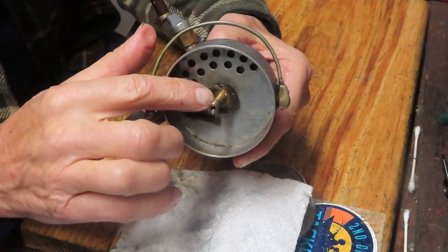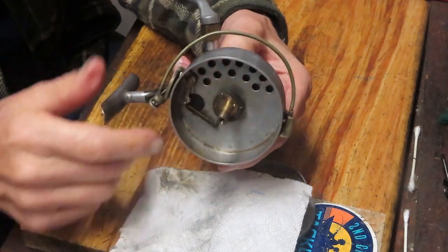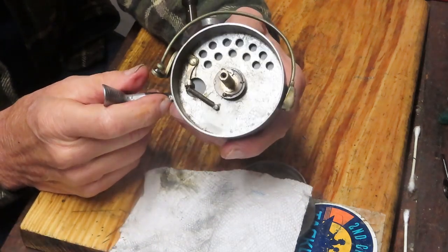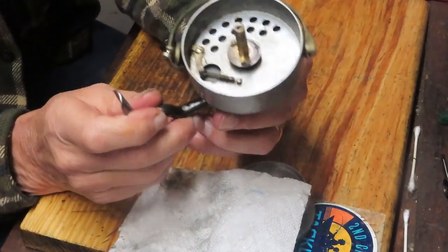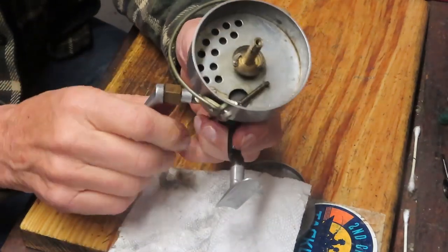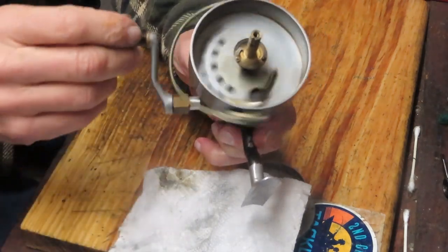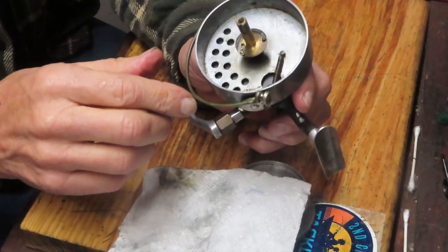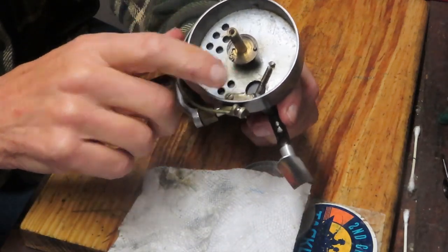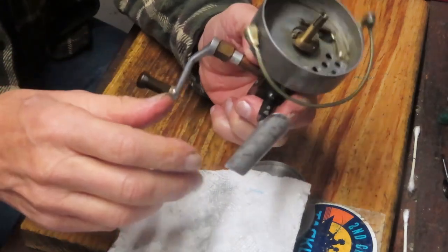And I don't have the punch or the push for that pin, and again, that's so well machined that you can't even see the pin there without reading those instructions. All right, well, if I had done that and succeeded, I still won't have the answer, because this is definitely a gear knock of some description. I've tried some things. I took the spring off of the rotor here, thinking maybe this was the cause of it, maybe it was bottoming out and so on, but it's not. It's not the issue there.